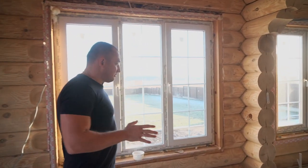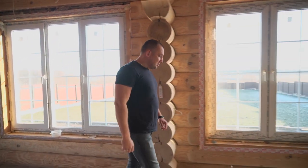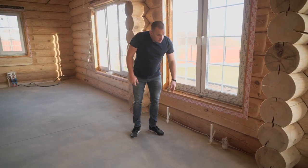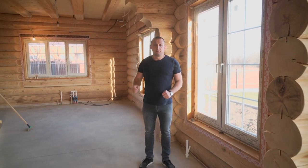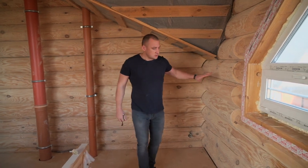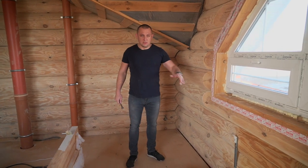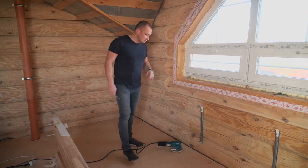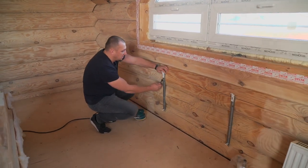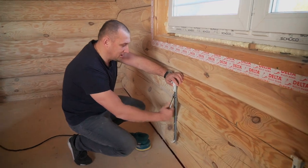Another important point — let's get to the radiator. They say a wooden house is a trouble. No, it's not a trouble — trouble is a construction mistake. We took off all the radiators because it needs to be sanded behind them; we had to unmount all house heating pipes and radiators. We'll also have to remove the stairway to have the house prepared and painted correctly. The walls are sanded, but there was a radiator, and as I said, it was wrong to mount the radiator before painting. To get that yellow area sanded and painted correctly, we have to remove everything — the radiator, the attachment — then sand and paint, then get everything mounted back on.